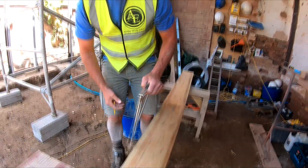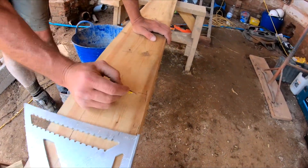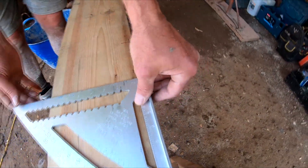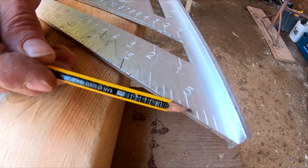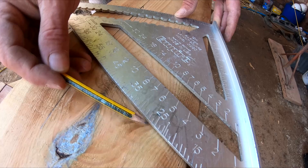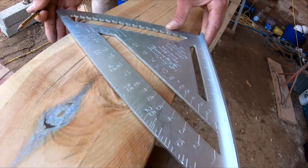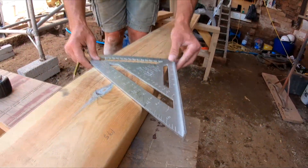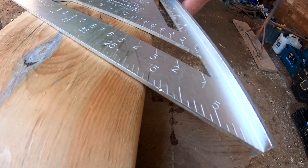The pitch of this roof is 15 degrees, which is a really shallow pitch — we're having a certain type of tile. Now, you always rest the pivot point of your roofing square on the top of the rafter, then move the roofing square out. On here you've got all the degrees: 5, 10, 15, 20, 25 and all the increments between — 16, 17, 18, 19, 20, right up to 45 degrees. You bring that degree to the top of the rafter, so for 15 degrees, keep the square tight and move it to 15 degrees like this, and that line from the pivot point becomes your 15-degree line.